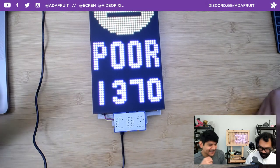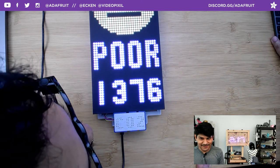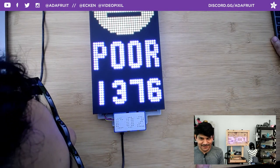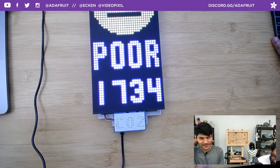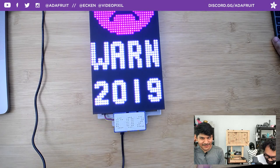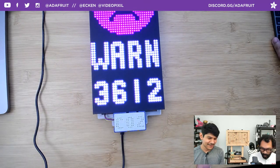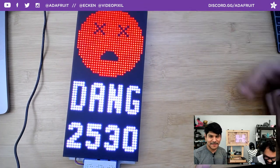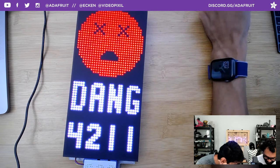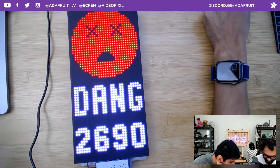Don't blow into it. Oh, yeah, let's go ahead and do that, though. So if I blow right into it, you can kind of see the timing of how long it takes to actually read that. Yeah, it went up 100, 200, 300. I'm trying to get to warning. Warning! You are breathing too close. Yeah, so this is what it's supposed to warn you about if there's a bunch of people in a room. So if there's a bunch of people in the room, it should warn you that the CO2 levels have exceeded safety.